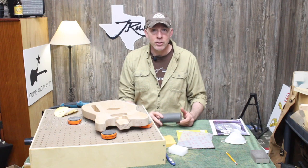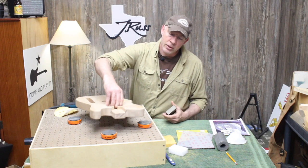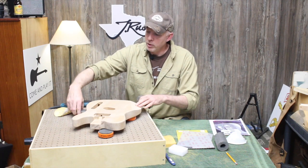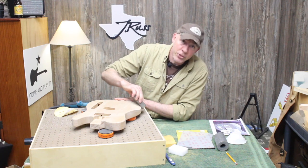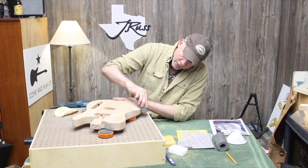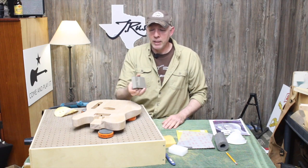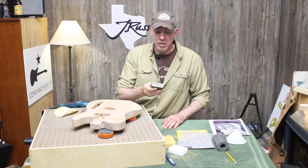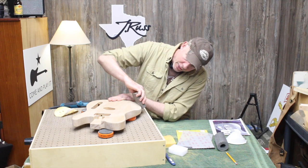All right, I'm going to go ahead and get started. What I want to start with is this rough block here to knock down the hard edges on my arm carve so I can get it prepped for rounding over. I'm just going to use this gently at first — just going to put a little bit of a bevel on this edge. This block is nothing special, you can get it at any Home Depot or Lowe's. It feels like maybe a hundred grit on the side I'm using right now, just to take this hard edge off.